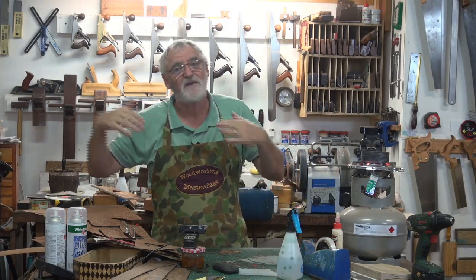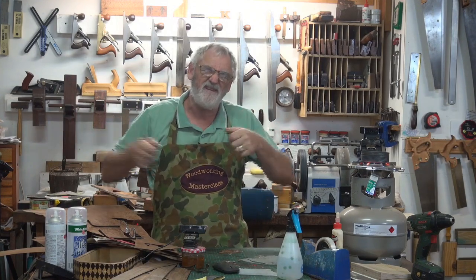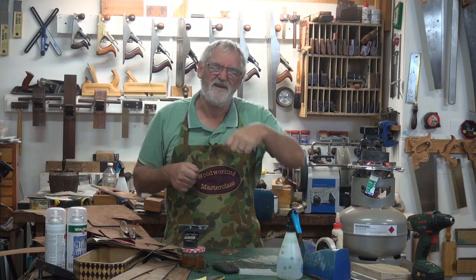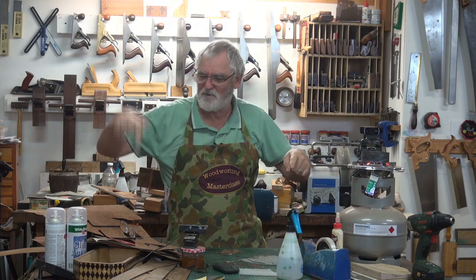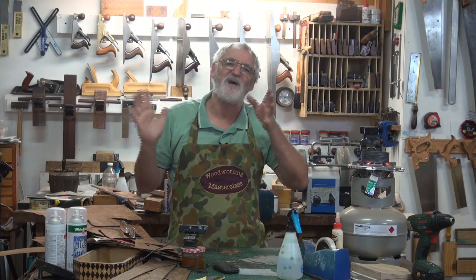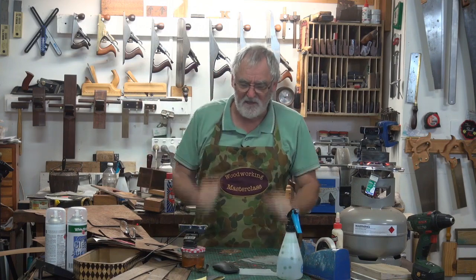and if it's going to be out, it's going to be larger in one diagonal, shorter in the other. If it's longer that way, you push this corner, and that will square it up. And if you can't get it square, what you do is you halve the difference. So bring it in slowly and slowly until you've got it.